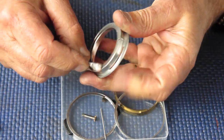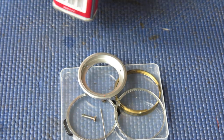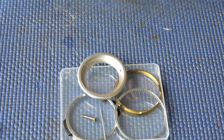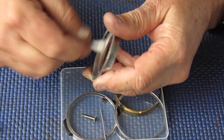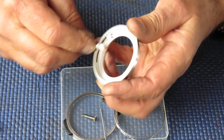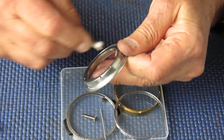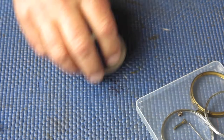This is by no means as important with the Retina 3S as it would be with a Reflex S. With a Reflex S it's very important that all the front rings work as they should — otherwise you may find the diaphragm doesn't snap down correctly, or you might not even get the shutter to cock correctly. If the control rings are bound up, that's a problem. Let's check the aperture ring.